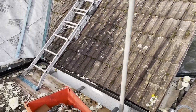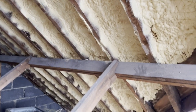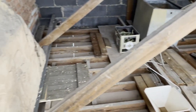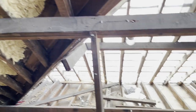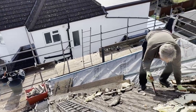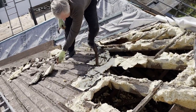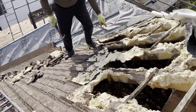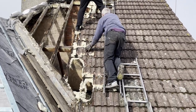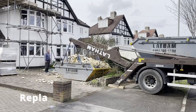Just to give a bit of background — we did the roof because of the structural survey that came up when we were first looking at the house. The foam insulation in the loft was causing a lot of problems: condensation and damp, because there was no ventilation up there for air to escape or dry out. The roof probably could have lasted a lot longer, but because the foam was stuck onto the tiles, getting the foam off would have involved getting the tiles off anyway.